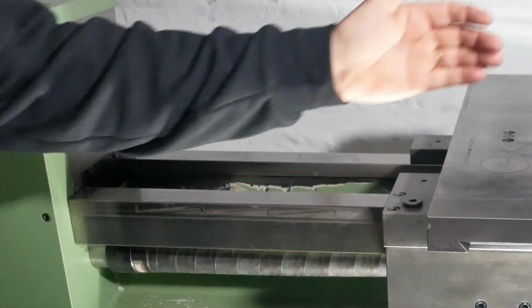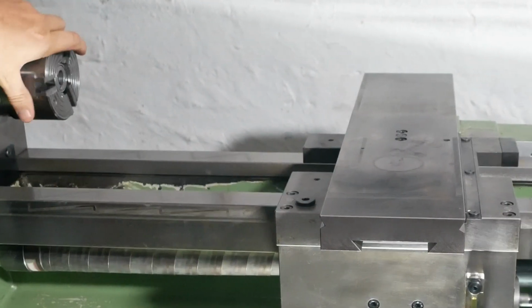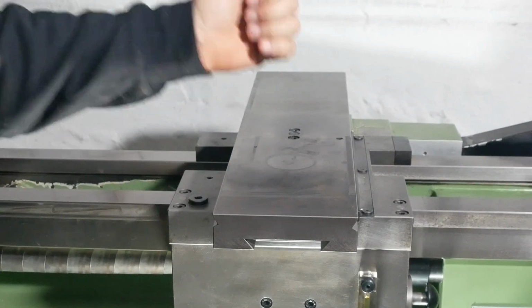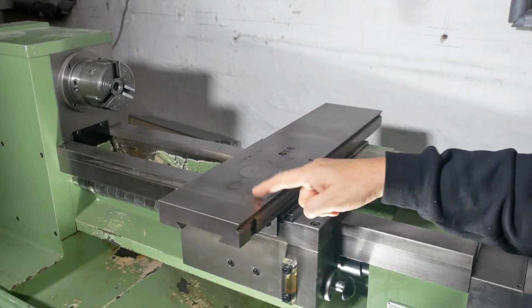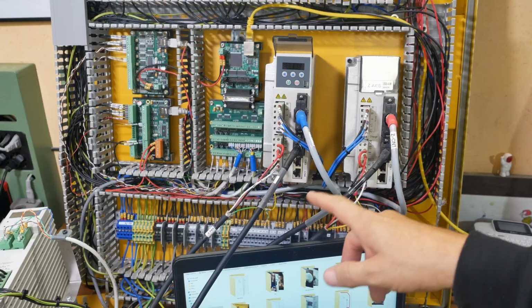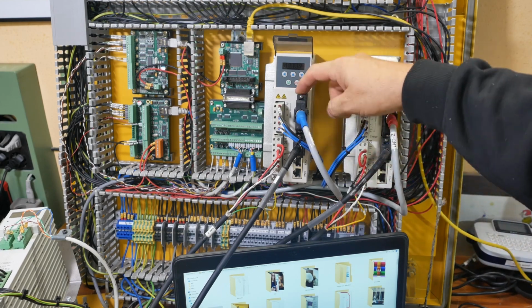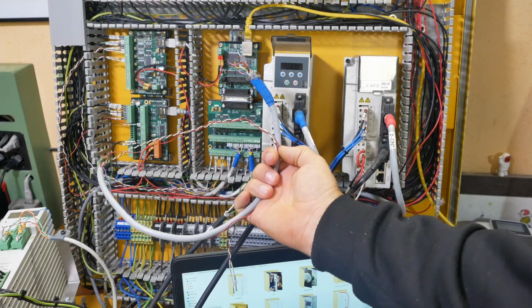Now, I've been working on trying to get some motion out of this beautiful old Schaublin 125 CNC lathe, which I lobotomized from its original controller and is now getting a LinuxCNC controller. But I've had a few issues. One thing is my cross slide wasn't working. Turned out my problem with the x-axis was that I got disorientated in the SCSI connector and I wired some of the pins back to front. So I desoldered it and made a new cable.